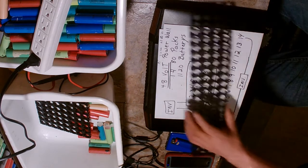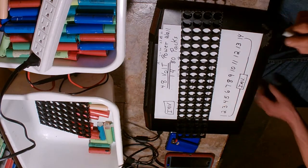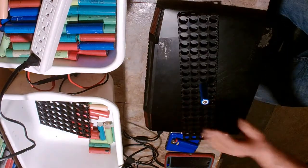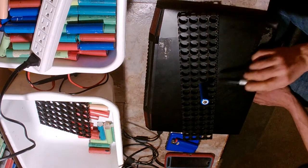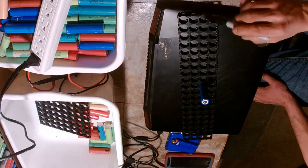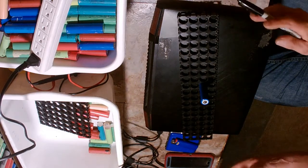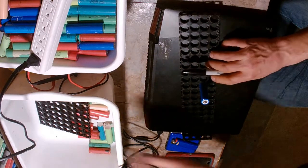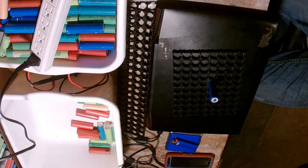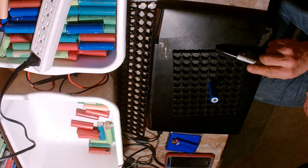Here's the normal 80-cell pack built 4 wide and 20 long. Think of it as an island - if you live in the middle of the island and there's only a road at each end, you've got to travel half the length of the pack to get out. The cells on the front end are out instantly - the power moves through them before it even hits the others.